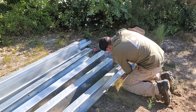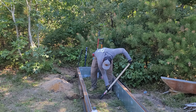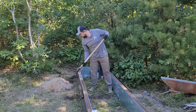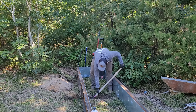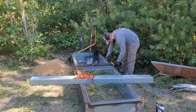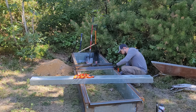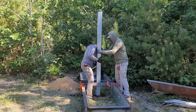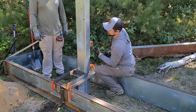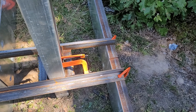Because we're going to be securing these into concrete, we have to run rebar all the way through the bottoms of the posts and pre-dig where our conduits are going to be, since it will be completely covered by concrete and we won't be able to dig under it or drill through it easily afterward. This H bracket allows us to get the posts perfectly centered and set so that when the concrete is poured it stays in place. Using large C clamps and a Klein digital level, we're able to get everything set exactly how it needs to be — I can't recommend this digital level enough. Here's a completed view of the H bracket holding everything together.